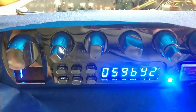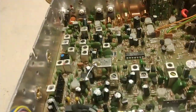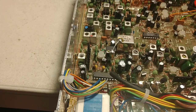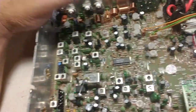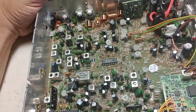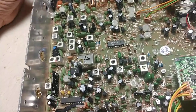We're back and we're upside down because we're on the bench. We've got the radio converted here — you can see 26.965, channel 1 on the display. I will say, these radios and just about all of them are being built in Vietnam now. At first I thought that might be a bad thing, but looking at some of the boards — I just did a brand new Galaxy 99 V2 — not as bad as I thought it would be. They're using different boards. Now these radios, just like the Galaxies, already come with the Schottky diodes and the receive now. They've been doing that for several years.